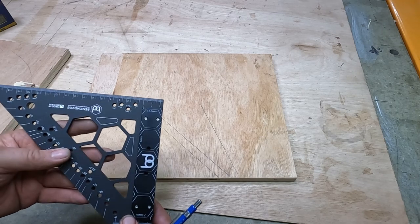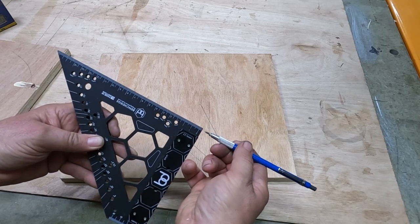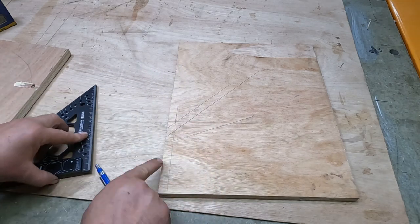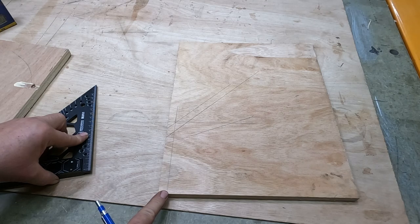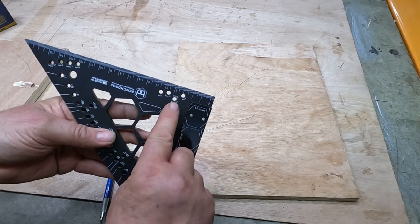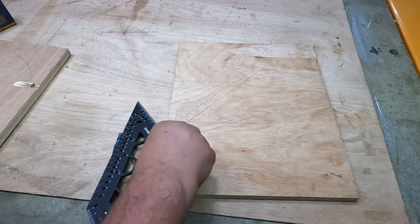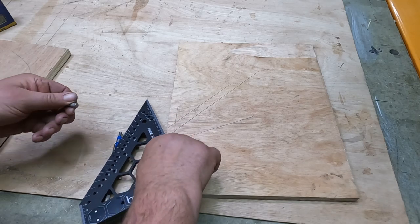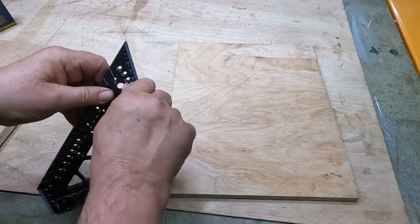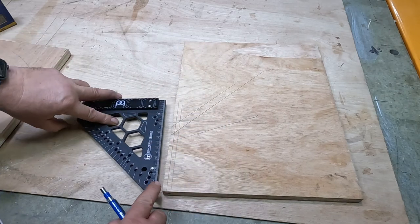If you're working with sheet goods, this has a few tricks all of its own. We have a 12 and a half millimetre edge from here to here, so you can put the square up against the edge and just run your pencil down there — that's 12 and a half millimetres for ply work. On here we also have 6, 12 and a half, 7 and a half, and 9. So if you were using 6mm ply, we could put it into 6.